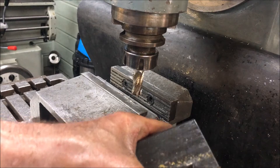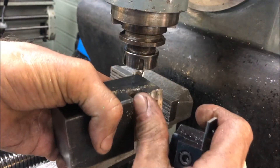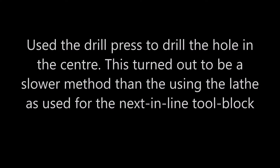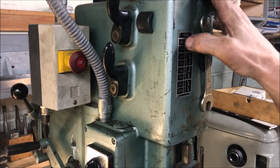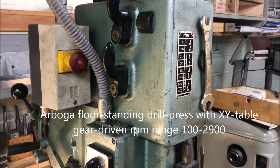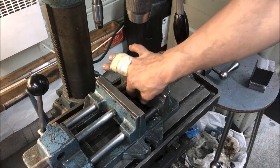This should match the profile here, like so. Just taking away the rag here. The Arboga has a capacity from 100 RPM up until 2900, so you can really do this here and it's gear driven. I'm drilling now — I just put a sacrificial plate down there.